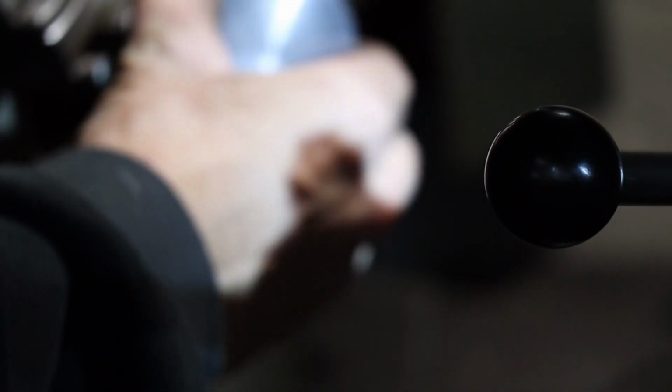So now we got this going on. See all the lines in my cap here? There's a lot of deflection. And my tool's probably dull, so one or the other, but there's my cap. Not too bad. Obviously there's still some scars in this brass here, but it'll live, she'll live.